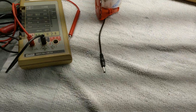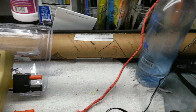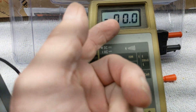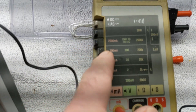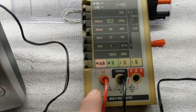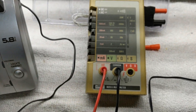So I'm going to try this with my Fluke and then maybe one other meter just for the fun of it since I've got everything set up. So here's the Fluke and we're plugged in — same setup. The power is on because we've got a reading. DC out on this 200 milliamp range, and milliamp reading out on this switch. I'm plugged into the milliamp side. But this meter is not reading — I think it might have a blown fuse or something else is wrong with it.